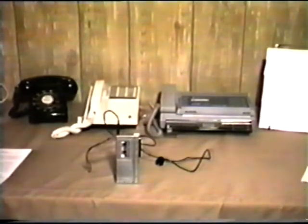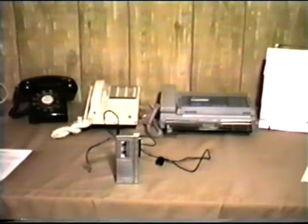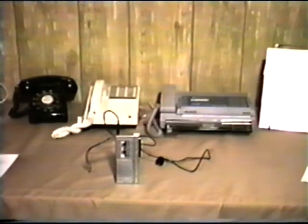Try to keep all background noise at a minimum while recording the quarter tones also. You should really have a good clean tape of nothing but quarter tones. We suggest not even fooling with nickel and dime tones when using the poor man's red box. Nothing is suspicious about a person only having quarters to place a telephone call with, so you should only record quarter tones onto your cassette recorder.